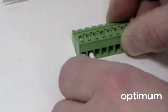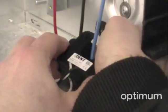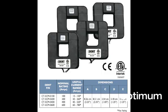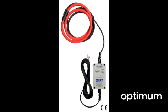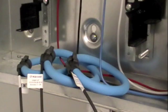Current transformers are interchangeable and connected using a well-labeled terminal block. Elite Pro works with split-core, clamp-on or flexible current transformers. Available CTs range from 5 amps right up to 6,000 amps. All models output a millivolt signal so they are much safer to work with than conventional 5 amp CTs.